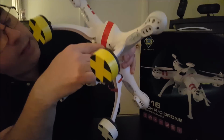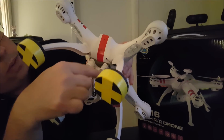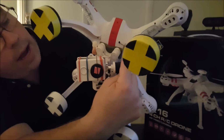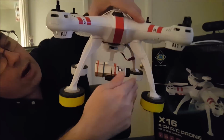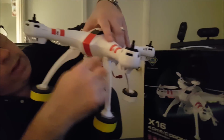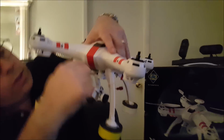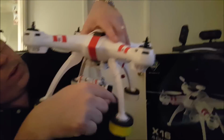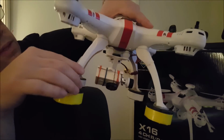And then what I did was I marked a little hole from the inside, and I drilled a hole, and I tied the antenna down the leg so it's more vertical, up and down, to get better frequency than being laid across this way. It was horizontal this way, and now it's vertical, which will give you more range. So I'll show pictures of that next, right now.